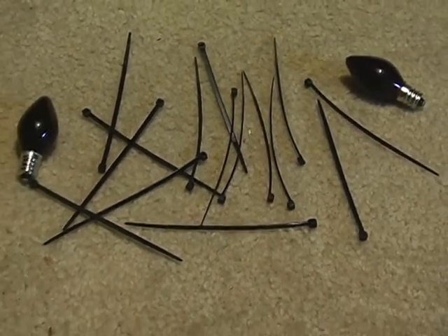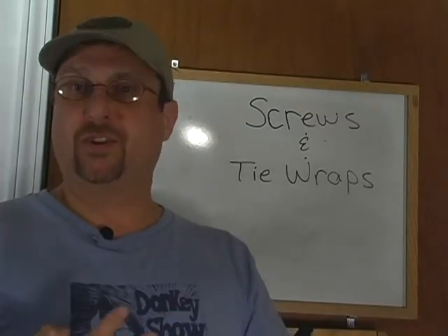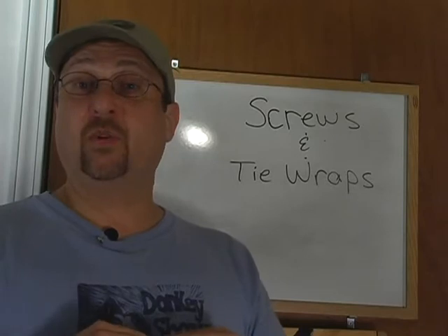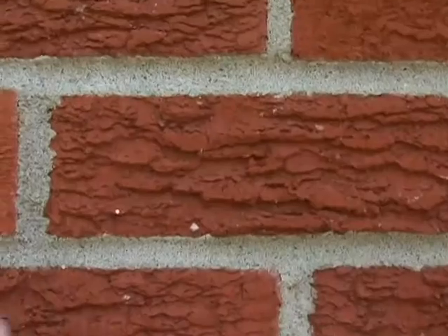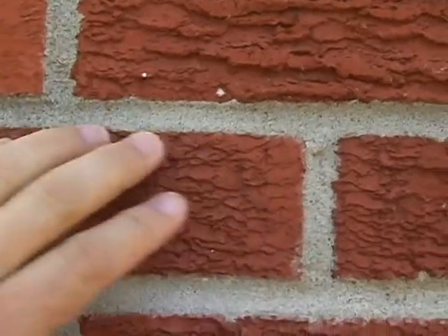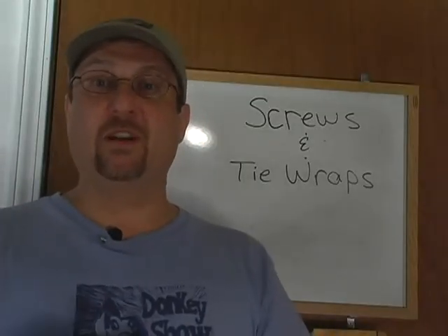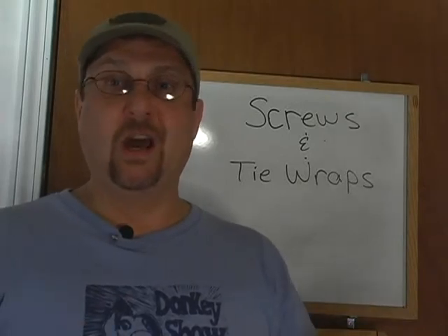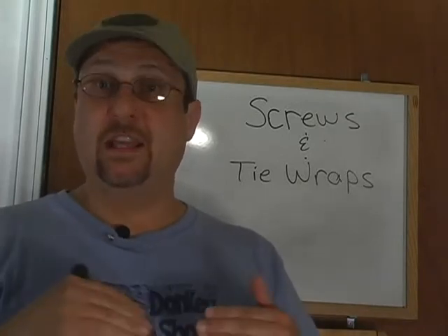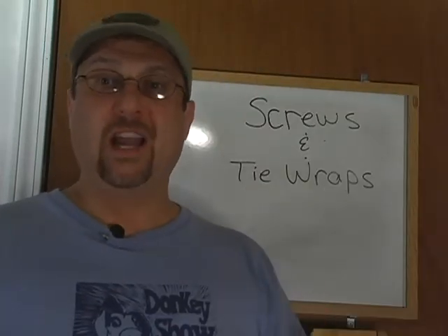This is a very good technique for brick or stone. You'll want to go into the mortar between the brick or stone — that's the best way. As mentioned in the mounting options video, it's a lot easier to fix if you ever want to remove the screw and not have the hardware there anymore, since you can easily fill in the mortar.